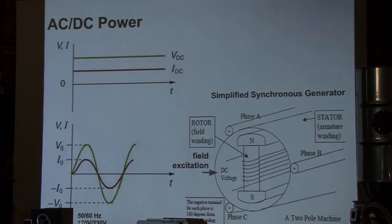In a simplified explanation of how the generator we're using works: there's a series of coils around the outside of the generator. On the 20K, there are four poles around it. There's an electromagnet inside that generates a field — it gets excited and generates a magnetic field. As the rotor spins around, that field rotates and creates increases in voltage and current around each of those individual coils. We're generating that field, and that becomes important in how we control the dynamics.